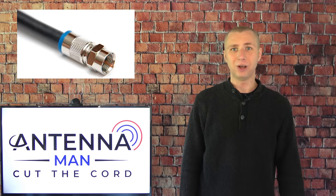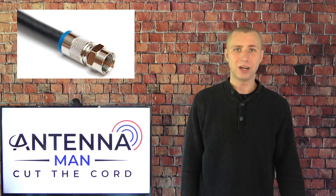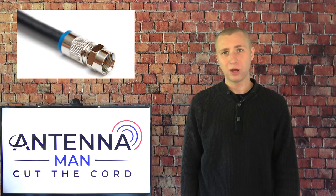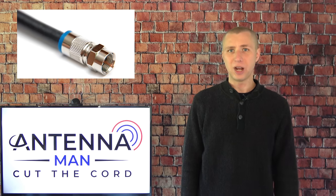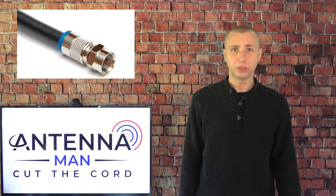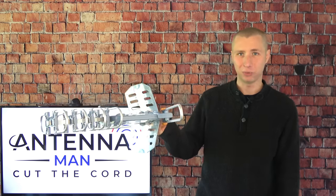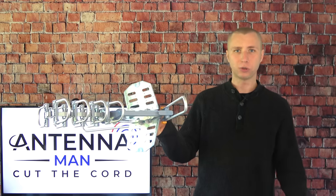What exactly is a long coaxial cable? It really depends on what kind of antenna you have, how strong or weak the signals are, and the coaxial cable you're using. A cheap RG-59 cable is going to have more signal loss compared to a quality RG-6 quad shield or RG-11 cable. I should also mention if you have an antenna that already has a built-in preamp, you cannot add another preamp on it, or it likely won't power the internal amplifier and you'll lose reception altogether.